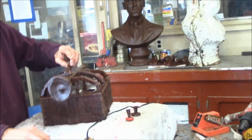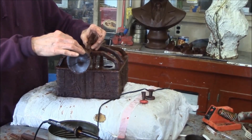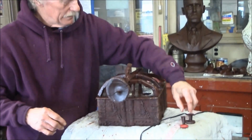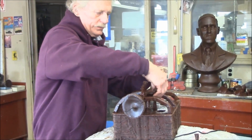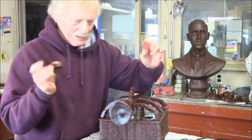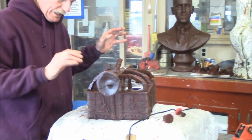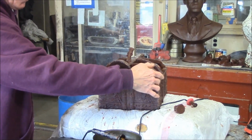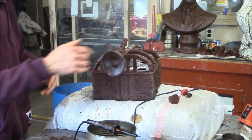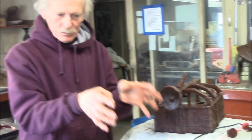These things will get welded onto this sprue here. Like this could be welded on here and then vented off here to the top of the cup. And these little guys can go pretty much all along in here. We've got about 8 of these little things to fit in here. So we'll get those put in here, and we'll put some vents coming up from the corners here up to the top of the cup. And then next we'll go to spruing up the top.